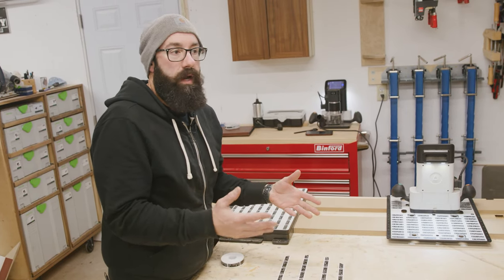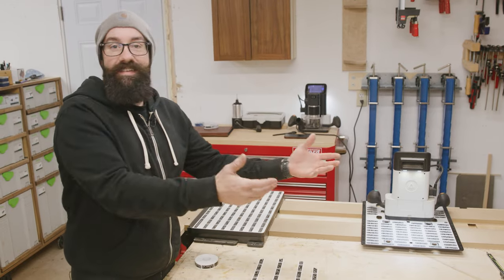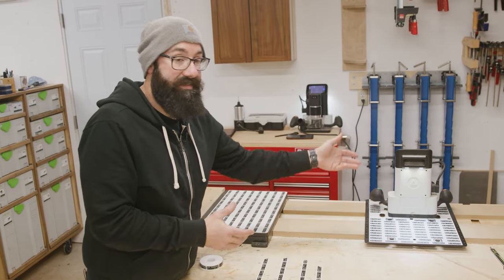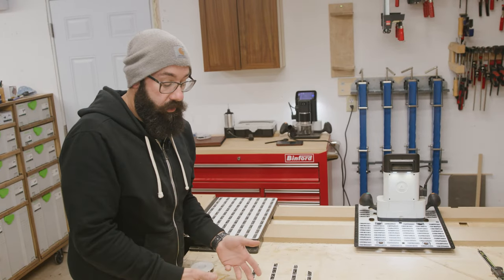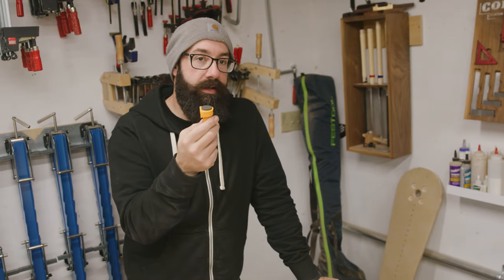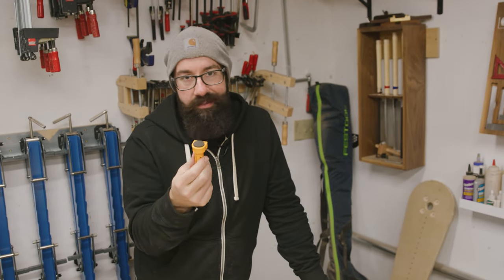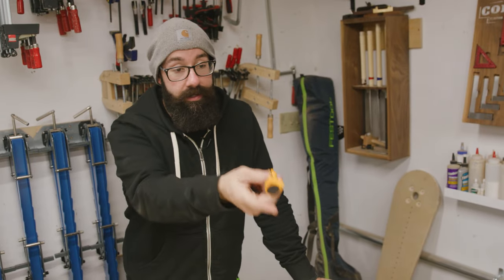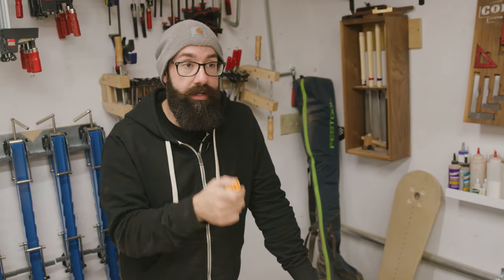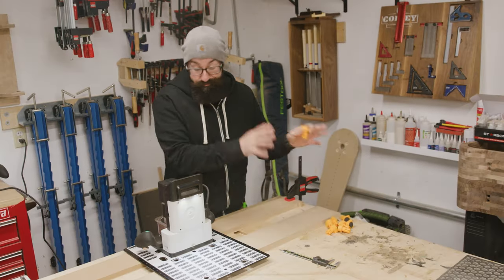The Origin needs those dominoes in front of it to know where it is in space - if there are no dominoes, the screen will say 'looking for workspace.' With the tape it's nice because if you're trying to do an inlay on, say, a big tabletop at a client's office, you can take the tool to the workpiece. You're basically able to take a CNC to the workpiece and get your work done. I bought these super cheap bench dogs off Amazon but I can't use them because they don't fit a standard 19mm or three-quarter inch hole - they're just slightly oversized. Now with the Origin I can make a hole that's the perfect size.